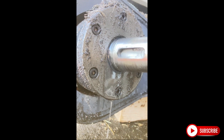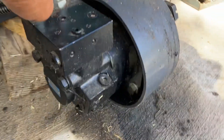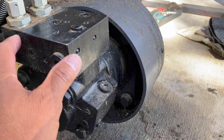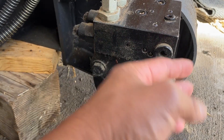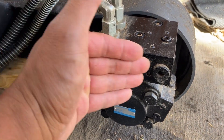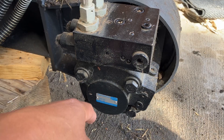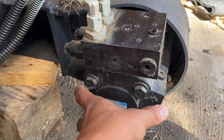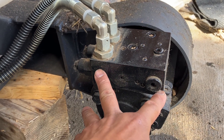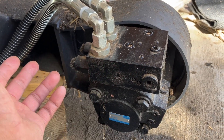This is the travel motor. It seems there are just two hydraulic fluid connections and four bolts that bolt onto the body — so releasing those should allow the motor to come out. Taking a closer look at the valve: this travel motor has a balance valve on top, which stabilizes the tractor when working on a slope so it doesn't feel like it's going to run off. Most one-ton excavators use a similar but smaller motor and definitely don't have this apparatus on top — I believe it's built into the motor itself.